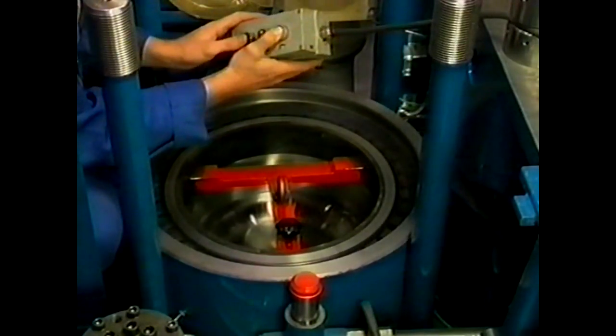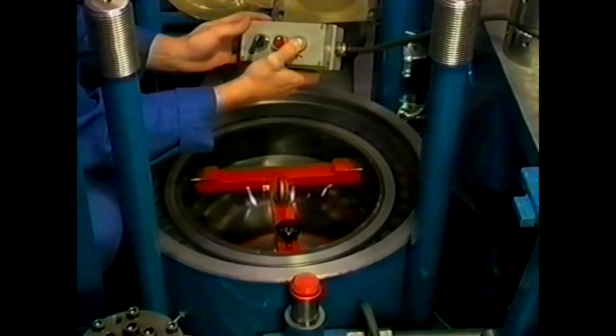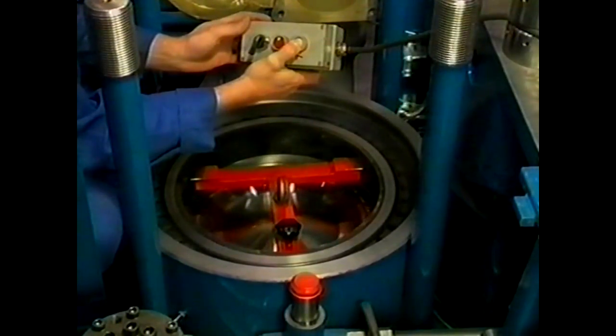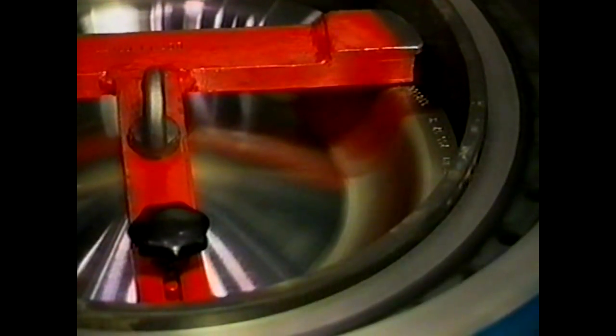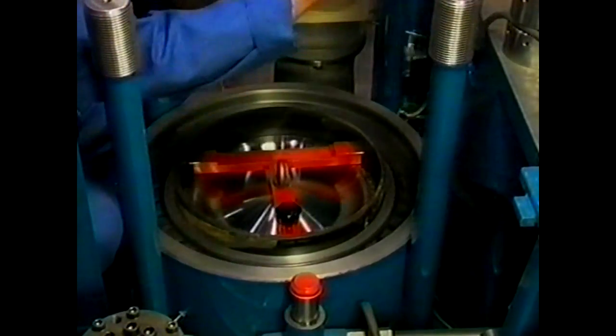To remove the anti-polishing ring, use a tripod extractor which can be fitted in three special grooves of the ring. First, try to tap the ring out of the liner using a plastic hammer. If the ring is stuck, it can be pressed out gently by turning the piston to top dead centre. When the piston is at top dead centre, the ring can be removed from the liner.